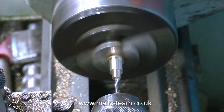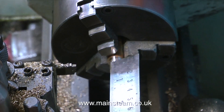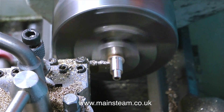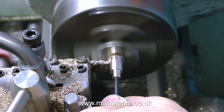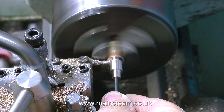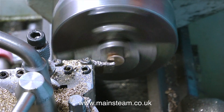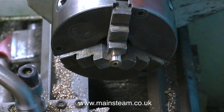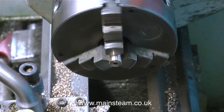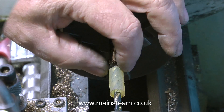In a moment I will be parting off this piece of metal, and you can see me positioning the parting tool so I get the correct length. The parting tool cuts through the metal, and then the part you've lovingly crafted falls into the chip tray. I don't do this — I put a small drill shank into the hole and that catches the part. Alternatively, if you like rummaging through a chip tray full of nasty sharp metal, you could practice bobbing for apples with razor blades in them.